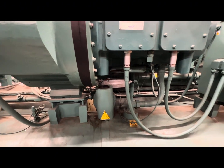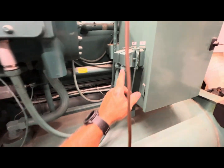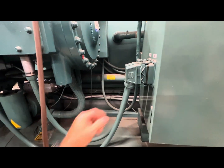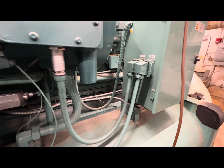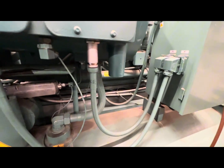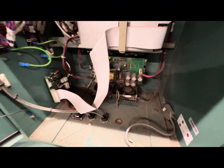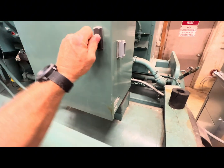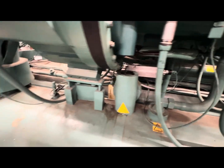I was thinking maybe we had a connection issue, so I pulled these apart to look at the pins — there was a lot of charring, it didn't look nice and clean, so I thought maybe that might have been a problem. First thing he says: 'The fans aren't working.' Well, fans are working here, so that's cool.